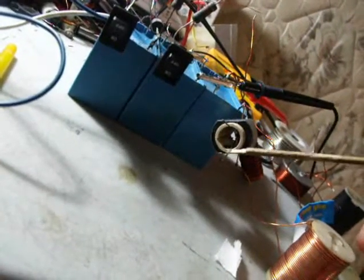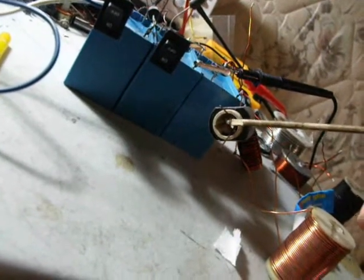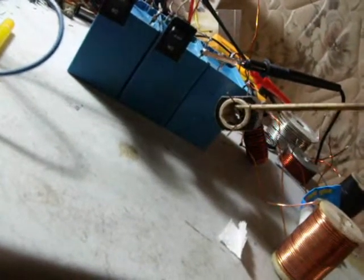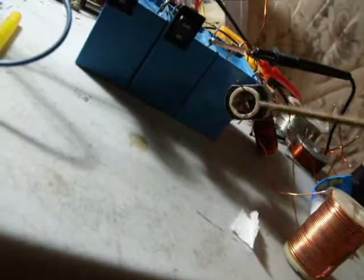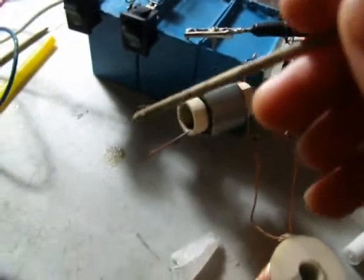You can see those rails coming together at one point, with a minimal distance of around 4 mm. The magnetic field of those two magnets goes perpendicularly, the same as the magnetic field between those rails. Like in a railgun, the magnetic field propels the projectiles — the same way the plasma arc is gonna be propelled upwards. The minimal distance between the electrodes is 4 mm, and here it is around 2 cm. Let's see what's gonna happen and how the arc is gonna behave.